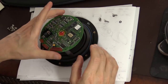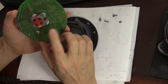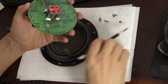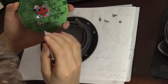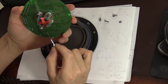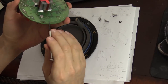I've screwed the main board to a stand so I can flip it around and show you what the sensor looks like. This is the classical design I was talking about. Here we can see two things: first, this brown coil — I think it's 48-gauge wire, several thousand turns — that's the giveaway that this is a pickup coil.